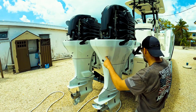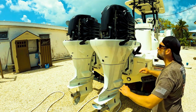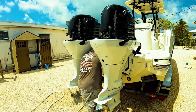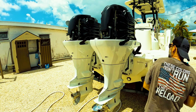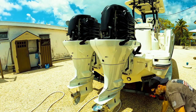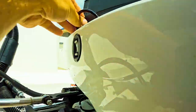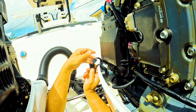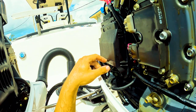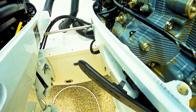There should be six screws total. There are also some from the other side, and it looks like I'm going to have to unplug the tilt switch, which is in that midsection cowling as well. The tilt switch is right here with a plug — pull the tab, pull out and up. That unplugs the tilt switch. There are guide pins right here for that.